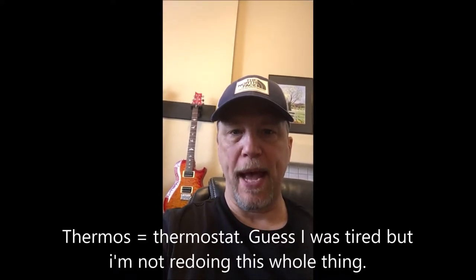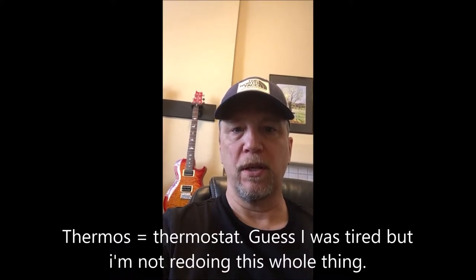So I went up in the attic and took off the covers to the heater to start troubleshooting. I took the left side of the cover off so I could see the gas jets, the flame sensor, and the igniter. I left the right side on because that held down the pressure switch that needs to be activated in order for the thermostat to come on at all.